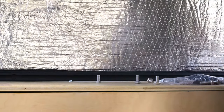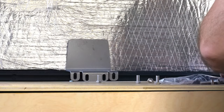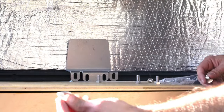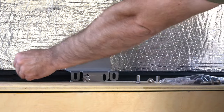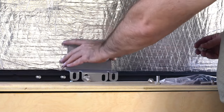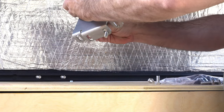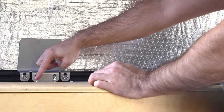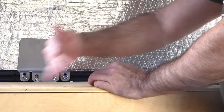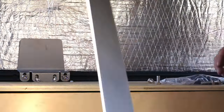These bottom brackets go on here like this, but the key is these bolts with a rounded flat head go on the inside and have to fit into the track. Then you fit these bolts through these holes, tighten them down so they can slide. These bolts have to go in before you can bolt these down, because when the water tank sets in and the bar comes over the top, it fits right there.